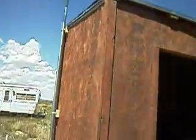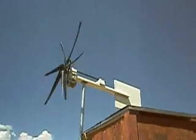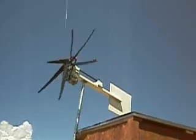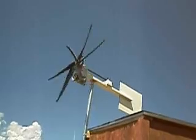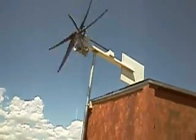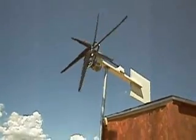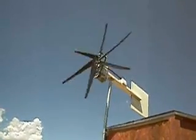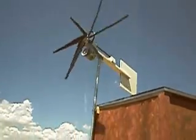Here it is up and in full flight. You can see it moves along pretty quickly, and remember that the motor is going two and a half times faster than the blades are, so that's certainly getting several hundred RPMs right now. The mast is a one and a quarter inch metal EMT conduit, and I have that hooked on the side of the shed so I didn't have to guy it. There are two saddle clamps holding it on.